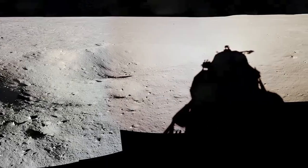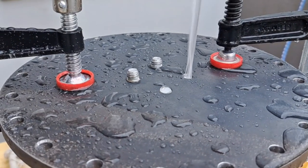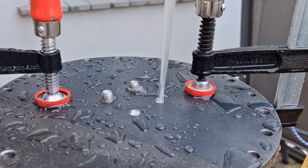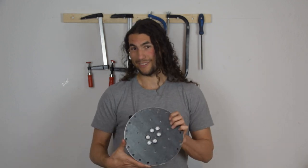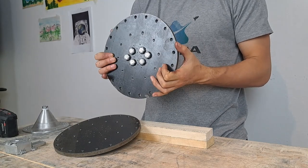After such an upgrade, it would be a real shame if we didn't test to see if this is actually working a bit better. And that's exactly what we did the next week. This time, we're a bit more confident that we're going to get behavior that we're expecting. It's quite clear that we were able to achieve an impingement with this type of injector — it's not a perfect impingement, there are definitely some flows that impinged a little bit later than the point that we wanted, but overall it was a pretty successful test. So we're planning to move forward with this technique to drill all of the impinging injectors we're going to make in the future. This is the final result: we have six bolts, each with four holes, which allow us to achieve the impinging behavior that we want. But we won't really know if this is working until the pressure test, which is coming up in just one month. We'll be putting both of these injectors to the test to see which one gives us the best performance.